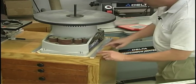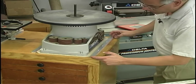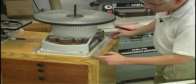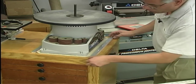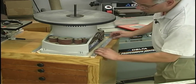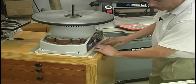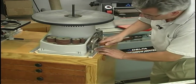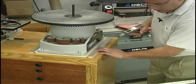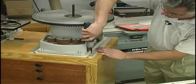Now you'll notice that I've got 2 screws in here where we drilled those pilot holes. I'm going to line up the front edge of this clamp / cleat with the front edge of the plywood top. That means it's set back 3/4 of an inch from the front. And I'll just hold that up against our tool. And then I'm going to tap these screws. That sets their position. Now I can tighten them up with my screwdriver.